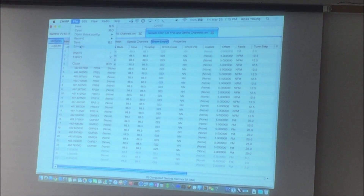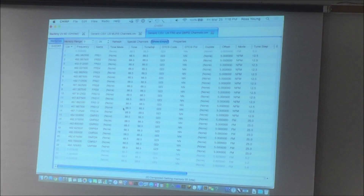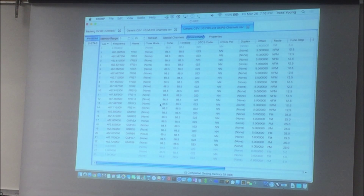Just like an Excel spreadsheet, you can save this as an image file. We did this for one of our earlier things where we bought about 30 of these radios — since I already had the config set up and they were all the same radios, I could just upload them fairly quickly. We had 30 radios all with every frequency from Arlington County, Loudoun, and Fairfax, with all the base frequencies ready for new people coming into the hobby — so they don't even have to learn how to program the radio. To manually do that by hand would have taken a very long time. I love it — it's free, it's fast, it's easy, and it's really valuable to learn.